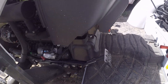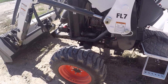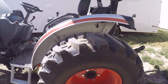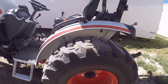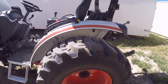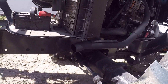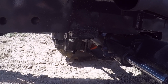One of the things they call for at every 50 hours is checking the torque on the wheel bolts. The front ones are 57 to 67 foot-pounds, and the rear ones are 144 to 166 foot-pounds. I'll put a torque wrench on those and check them. They were fine before, and I'm guessing they're probably fine this time — and they checked out fine. Apparently Brutus from the wheel department got to them too, because they didn't even budge, so they're probably at the very high end of spec or above.